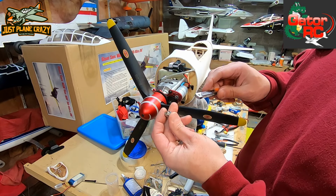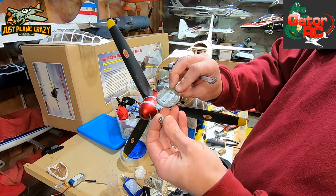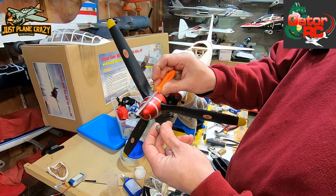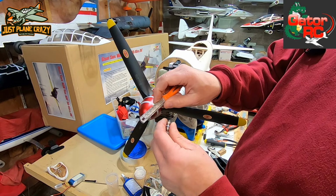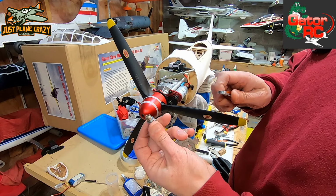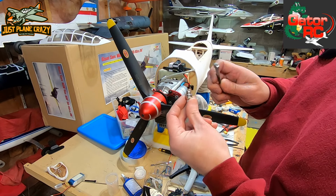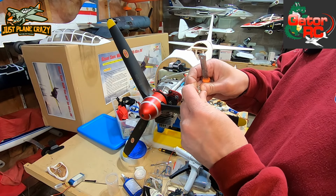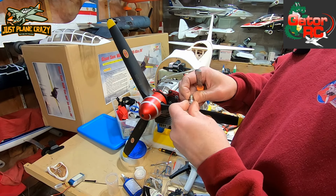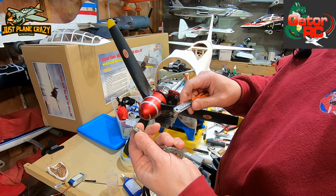When you go to set spark plug gap, there's a couple different tools. So this something is really old school, and that measures in thousandths. And then you have something newer from like Snap-on tools that would have a metric on one side and a thousandths on the other. There was no specification for this in the book as far as what the spark plug gap should be. I did some searching around on the internet and found nothing. A lot of typical engines around the DA50-60 size are right about that 20 thousandths, so that's where we're going to check and set this.